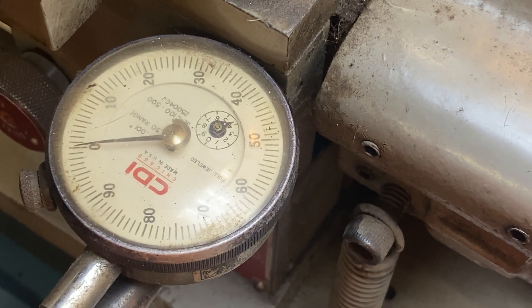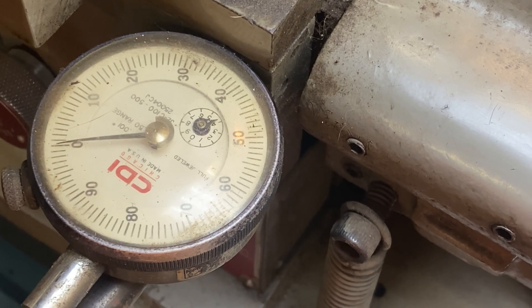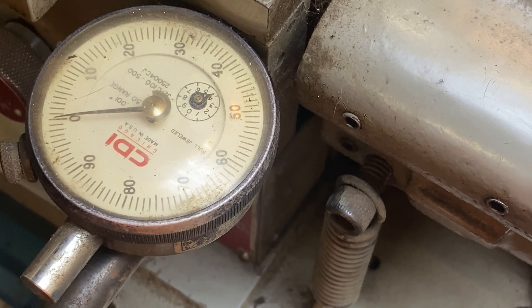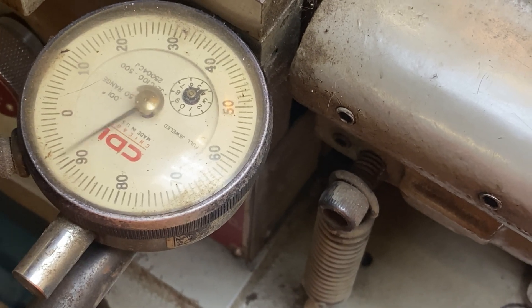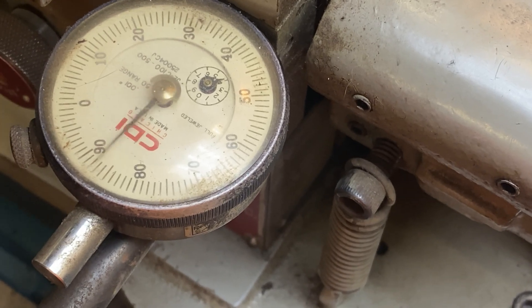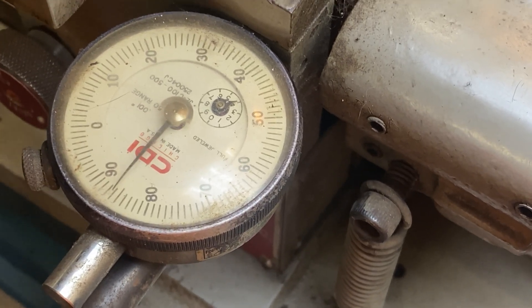Over that 32nd of an inch or so of marker line width, to get that to be 3 thou worth of clearance, the machine — as you can see — is running a total of about 20 thou relief per cycle.